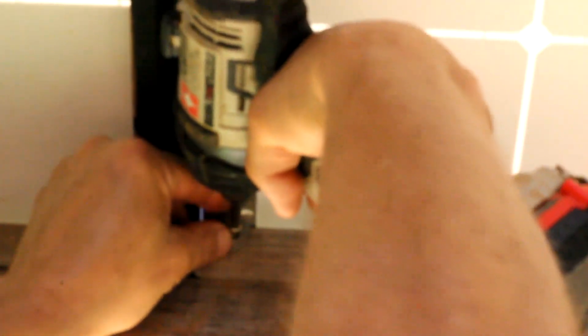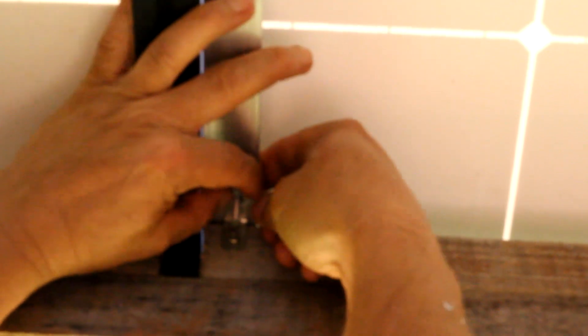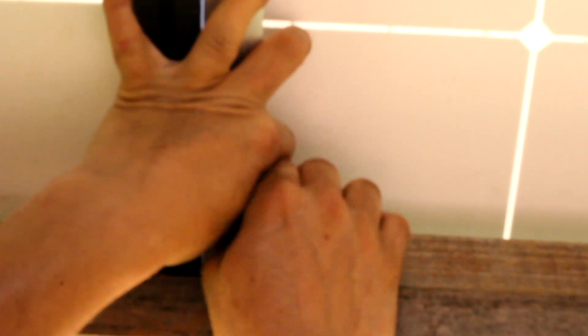After you get the solar panels on, you put the L-brackets on. I just take a deck screw and screw it in to secure the bottom part. The holes don't always match up, so I have to drill a hole — and you have to be very careful drilling through the aluminum because it drills so quickly that you could zoom right through into the solar panel on top. Luckily I didn't do that. Then I use these little one-eighth-inch by one-inch bolts, put a couple of washers and a nut, and secure them.